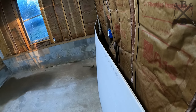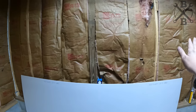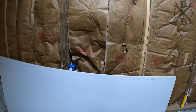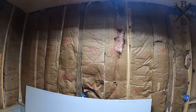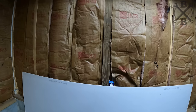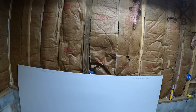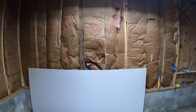There's our first piece of drywall — it's got some slight curvature, which considering none of the studs are lined up, I guess it'll wrap around nicely. We're going to start from the top and work our way down. None of these are two-foot on center or four-foot on center; they're all over the place. So as we go, we're just going to have to makeshift them wherever we can make them work. Let's just get started and go to town.